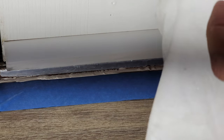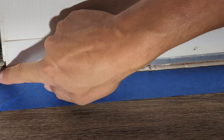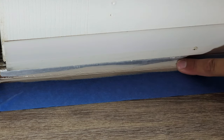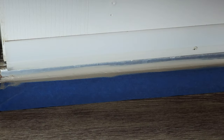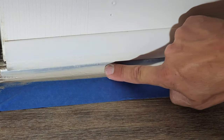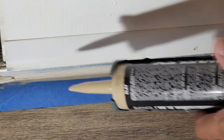You're going to take the wet rag, wet your finger, and then you're just going to go like so — smoothing the silicone bead. I like to go over it two to three times so that way there's equal pressure. It makes the cleanest, smoothest joint. Put a little bit more right over here — not much, just a little bit.